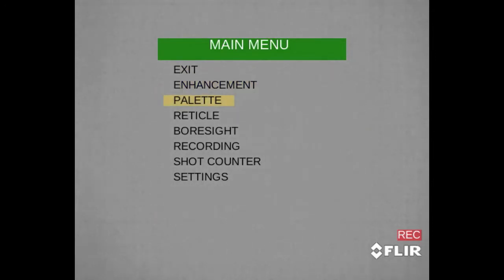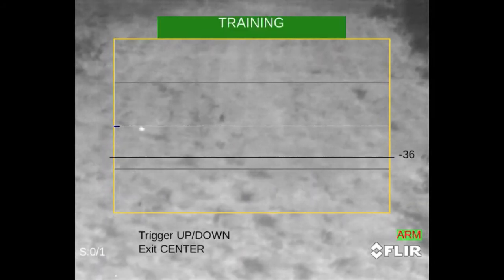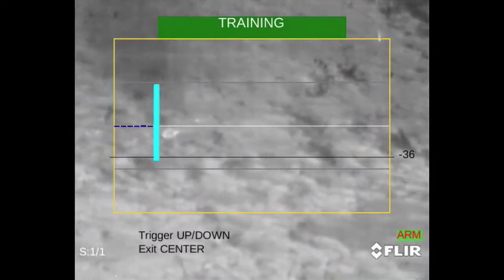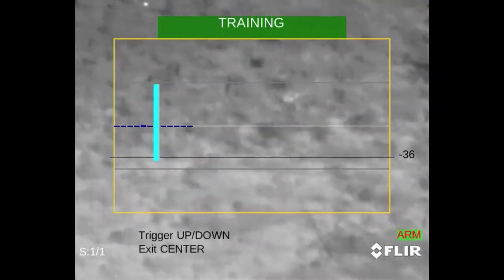It's fairly simple and straightforward. First step is to navigate in the main menu to the shot counter menu. Once in your shot counter menu, navigate down to the training mode and fire a few rounds. This will give you a range value of your specific cartridge in a blue bar graph. Next, adjust your up or down arrow so that the black line sets in the lower third of the blue bar graph. This will ensure that your device will record when a shot is initiated.